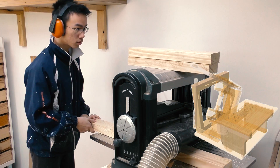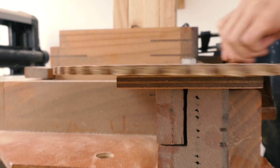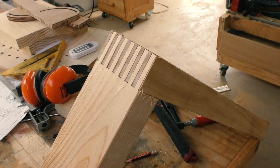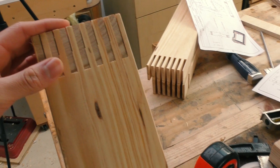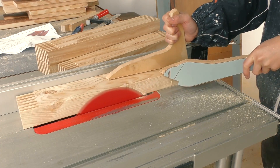With the table done I can move on to the template holder. When I was making the box joints for the corners of the template holder I actually used the wrong blade, which was 0.1 of a millimeter narrower and also had 60 teeth. As expected, a very tight joint — I'm going to have a lot of fun trying to glue this together. I also have some gaps at the back because the two passes didn't line up exactly, but that should be alright because a box joint for this application is already overkill. Now I can cut them to width by referencing off the fingers.